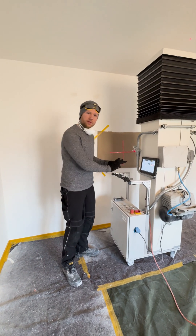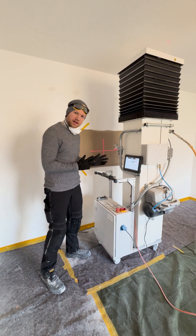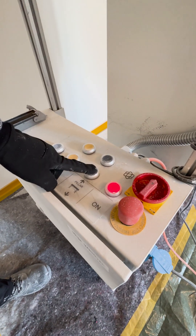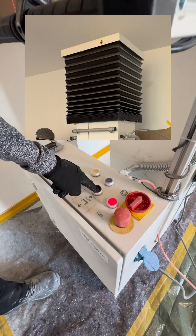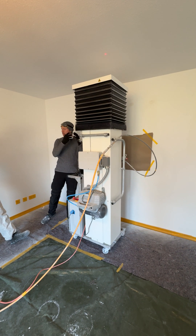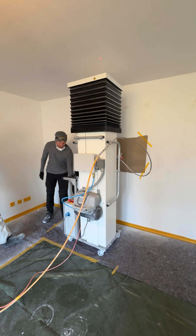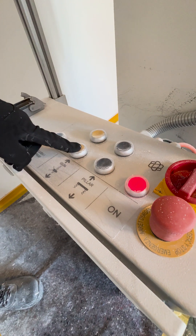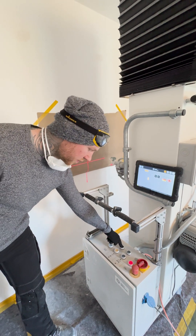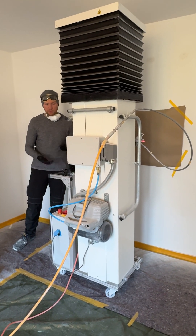What we decided to do for this drive unit is take a couple of the functionalities that we already had on the tablet and make them analog buttons. So for example, we can press this button to change the pillar height when we need to go through doors or anything that's hanging down, like pipes in an underground garage. The second button is to align the guns to make them go up or down. This is how I move the bot up and down, and the blue button is basically just to spray material — important for cleaning or for what I'm about to demonstrate next.